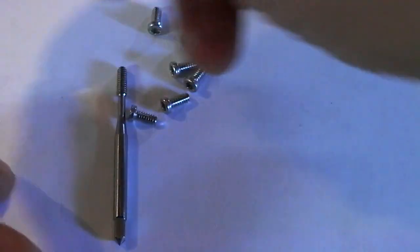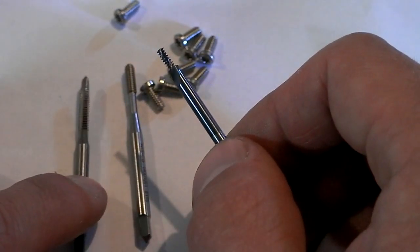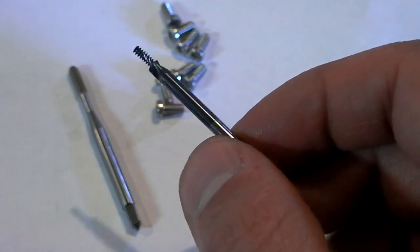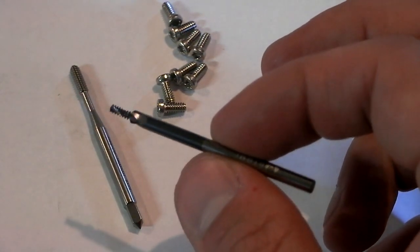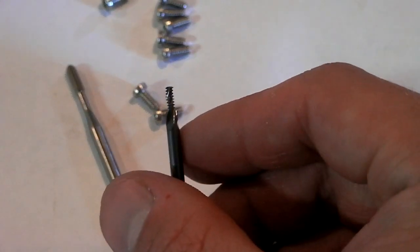Anyway, so that's way number two — these are awesome. But because you have to use the spring-loaded holder, you can't really do blind holes all the way to the bottom. Now, this is called a thread mill. To give you some idea on pricing — maybe $5 for a hand tap, almost $15 for a form tap, and a thread mill starting at $50. I've seen them go as high as $180, which is ridiculous. $50 for this is the absolute cheapest price I could find from lakeshorecarbide.com — I'm really glad I found that website, they have cool stuff.